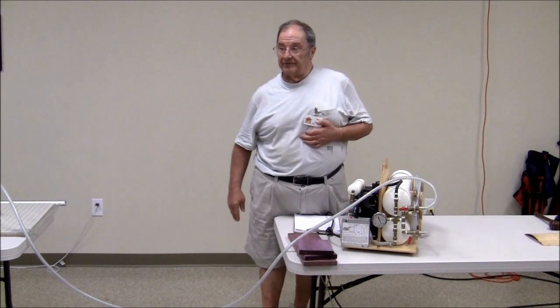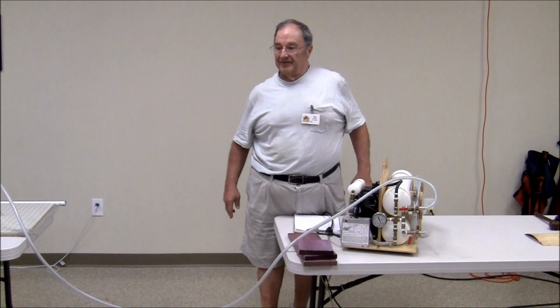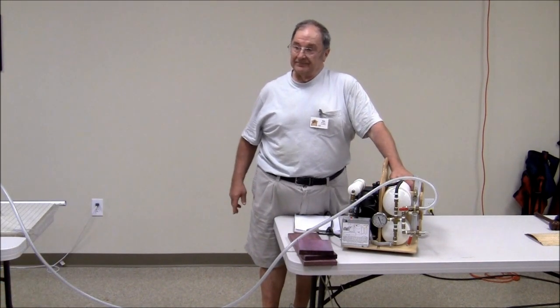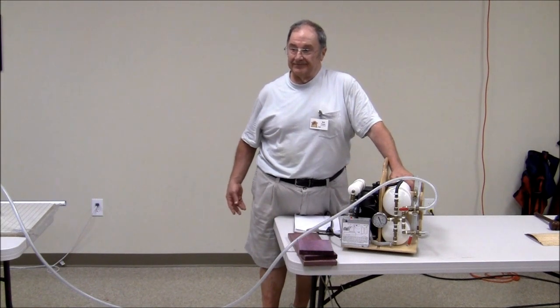No, don't need storage tanks. It's pressure. Your pressure tank is your storage. Well, the compressor is not storing your vacuum. The compressor is storing air pressure. Yeah, right. The air pressure is what operates the vacuum. Yes, but you got to have air flowing through that venturi. You still got to have some sort of a vacuum storage, not just the bag.